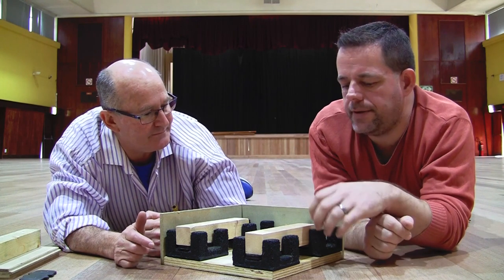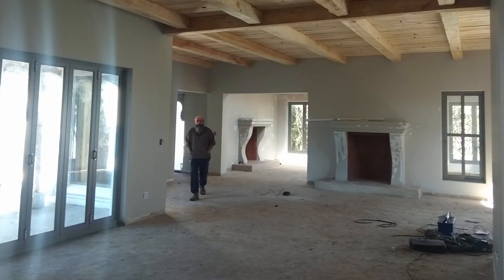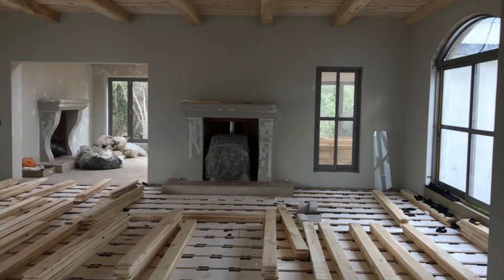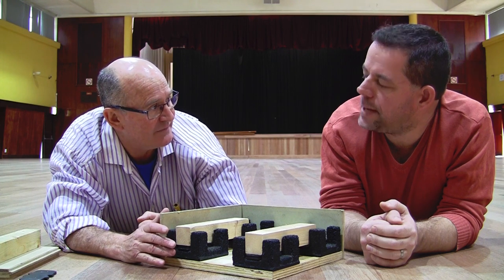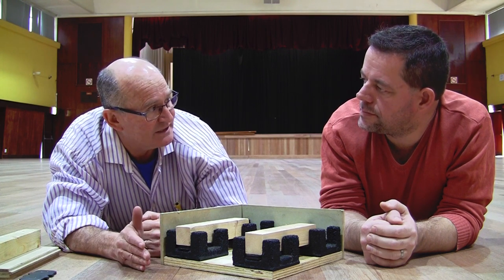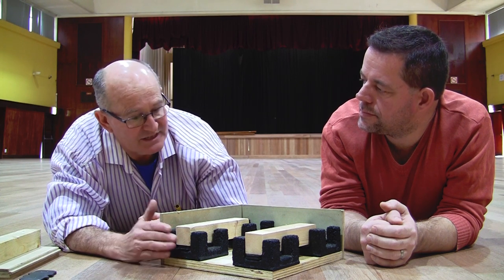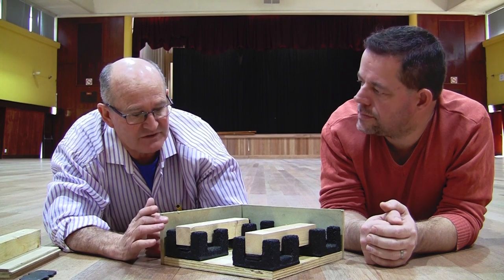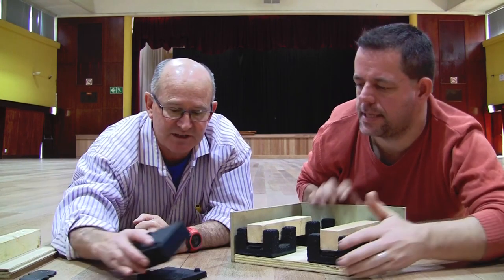Where you've got an internal system where maybe your substrate isn't absolutely sound, you can float your floor directly on top of it. This system is designed so that in large buildings and apartment blocks, they don't need screed. In Europe, conditions don't allow screeds to dry rapidly, so they delay the building process while subcontractors wait for screeds to dry. This system goes directly onto the slab, and with the ability to build the system up — shall I show the base packers?